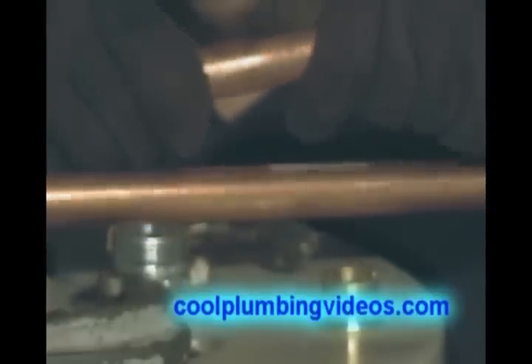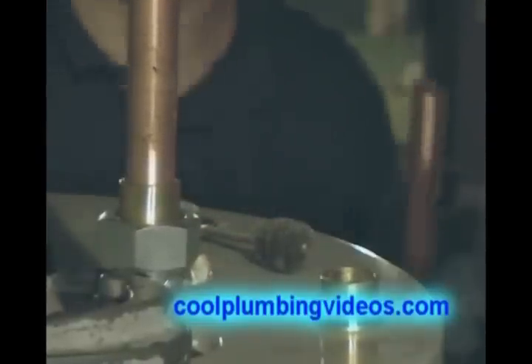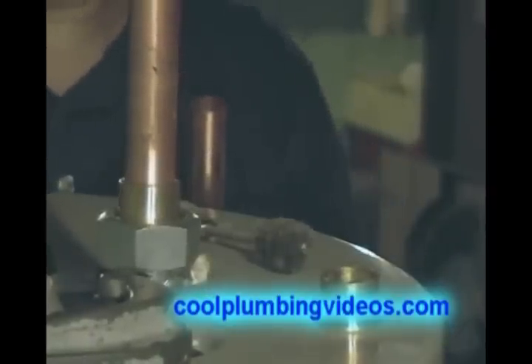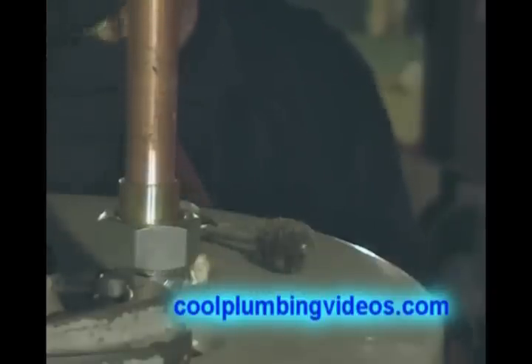And this small piece is what you might call a random piece — just a piece that you grab, about the size that you feel you might need. Okay now, you see that I'm putting the union together, but I'm not putting the plastic insert in there because I don't want it to melt. But once we solder this to the brass adapter, we will take it back apart and then put the plastic insert back in there.